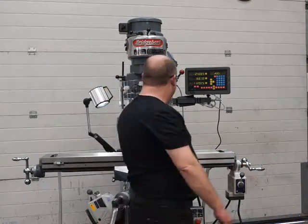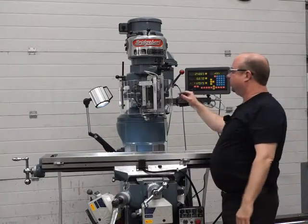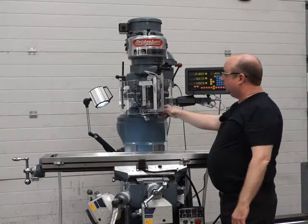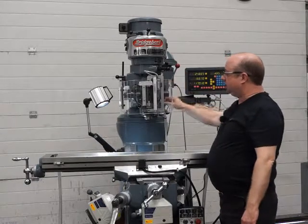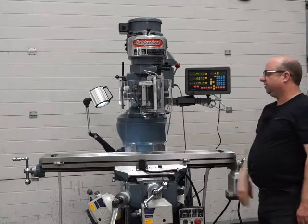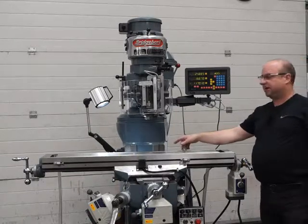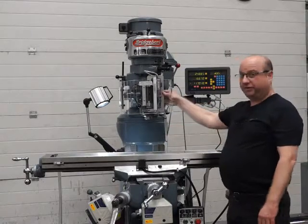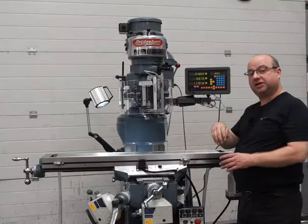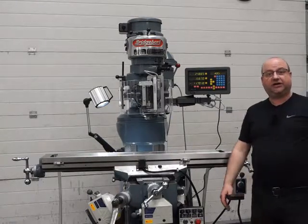The quill feeds up and down really nicely. We have a quick-release handle so you can adjust it to wherever you need it to be — a really nice feature. There's also a quill lock: push it all the way up to the top, lock the quill stop, and the handle is locked for doing any milling. There's a four-axis DRO system fitted: X, Y, knee as the Z scale, and a quill scale as the fourth axis. They sum together — when you move down on the quill and up on the knee it gives you a reading as though the hole has gone deeper. Lovely machine, fully rebuilt — please come down and see it for yourself. Thanks for watching.